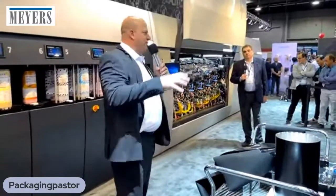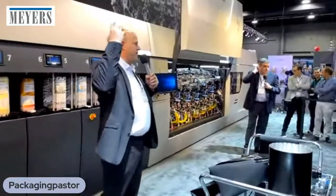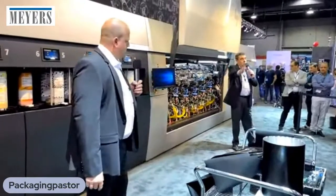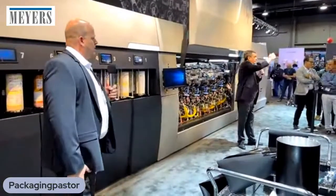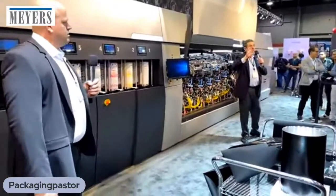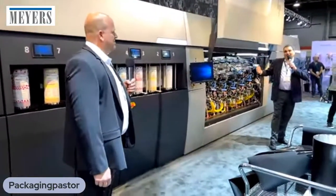You have 4 different flexo presses, replace 3 of those with a single V12. The V12 will handle the entire job that those 3 flexo presses handled before. There will be a point, though, that being said, there will be a point where flexo production costs will dip below production costs on the V12. But from our math and input from our customers, we've had these discussions, that is going to be the very longest of long run lengths you will take on. And more than likely, what we might call simple or industrial type labels. But we'll see how our customers use it. We're excited to get it going.